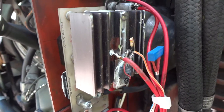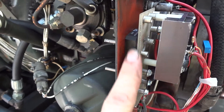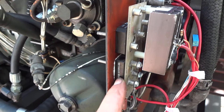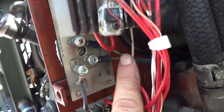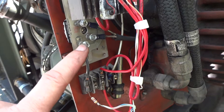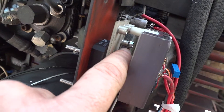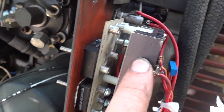Of course you've got to rectify it first before you can regulate it. I just happen to have this board — I didn't make it, it came out of my junk heap. It had two full bridge rectifiers on it, of which I'm only using one. I brought the wires from the stator over to the AC inputs on the rectifier, hooked the ground output up to ground, and underneath in the back there's a terminal where the positive came out — that jumpers over to this heat sink.